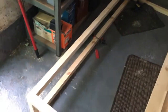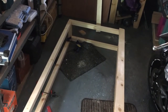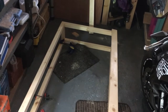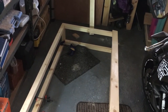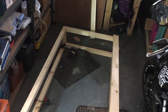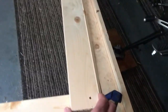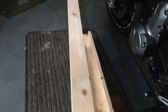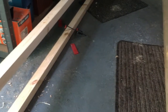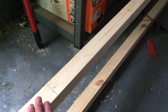I've made the frame using Kreg pocket screws which are quite a strong construction. I'm now about to build the top and have a rethink, because when you extend the sliding slats on one of these beds it's a little bit less than double the width. Double the width of 2 foot 6 is obviously 5 foot. So I'm about to rip down some timber which should get me near as dammit up to 5 foot — 58 to 59 inches. If I use the standard 3x1s I'm going to lose about 4 inches of width when it converts into double mode, but by ripping this down to the width of the 2x2 I should gain a few more inches, and I'll show you that when I build it.